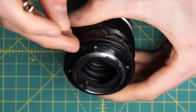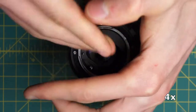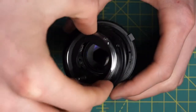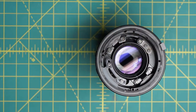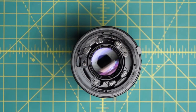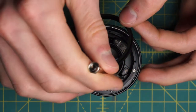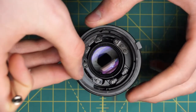We'll start by removing the mounting plate — the section with the mount itself and the plate behind it. It has four little silver screws going around. Be careful when removing these pieces. The mounting plate has the stop-down lever control on it. Some other pieces are loose — there's a section that turns around independently indicating where the aperture is currently set. Underneath this are a set of ball bearings and little steel pipe separator things, all completely loose, so be careful not to lose any of those.